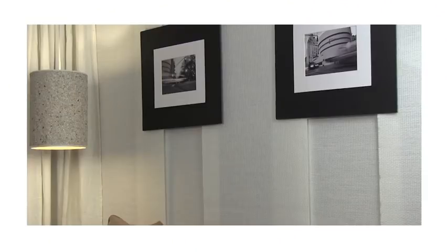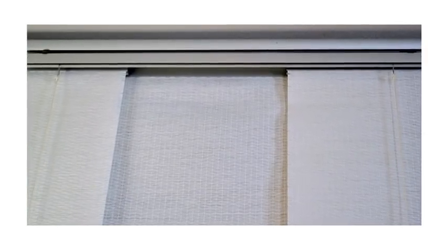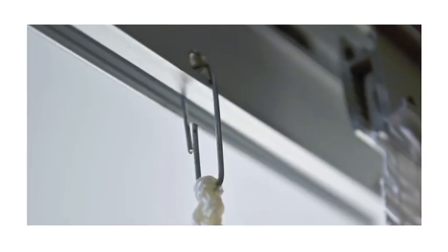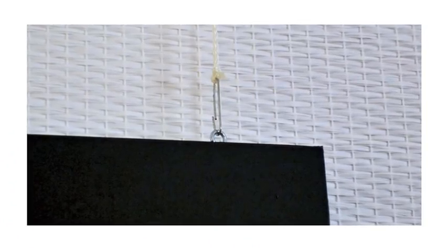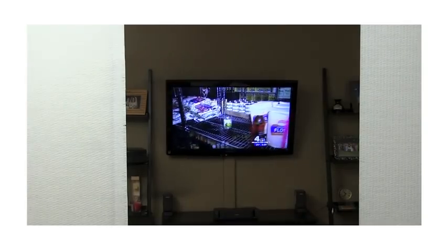What a transformation — you can't even recognize this apartment anymore. There's now a well-defined living room completely separate from the bedroom, and the panels really do act like a wall. Not only is there a visual separation between the living room and the bedroom, there's also room to hang artwork. I attached the artwork to a top rail with S-hooks that I made from paper clips going through the existing holes of the rail, then used another S-hook to attach the artwork. I placed the rail on the front track so that if you want to watch TV from the bedroom all you have to do is open up the panels, move the art, and you're good to go. I did mount the artwork on foam board to keep things light, because I didn't want to add too much weight to the track. If you want to hang something heavier, I'd recommend installing a single track in front of the one you've just installed just to hang the artwork.